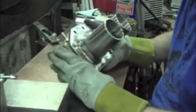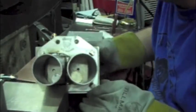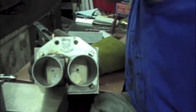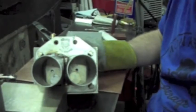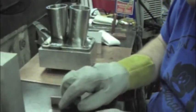Okay, so that's the hard part done. The center section between the risers, the runners, is all welded up, and just got to run that final bead around the outside. So we'll do that right now. I'm gonna switch everything back, get my pre-flow right, turn down my gas flow, save me a few bucks on the gas, and switch out to the regular number 8 gas lens again. Okay, back at it. Just going to run this bead around, and then we'll be just letting it cool.